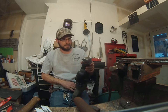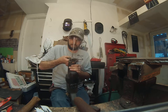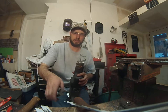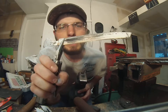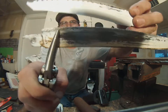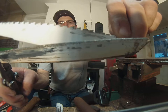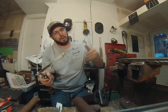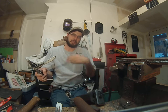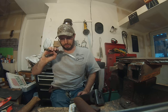But it will at least do it. Let's see — it does look like it started to pack up. Basically what I mean by that is, if you look at the grit down here at the bottom where it was doing the most cutting, it's starting to fill up and gum up, whereas out here it's not. These thin blades get hot, the metal gets hot, and then as soon as they bind, they flex — and that's when it starts flapping around all over the place. That's why these thicker blades are better, especially when you use them in longer cuts.